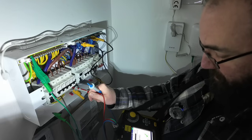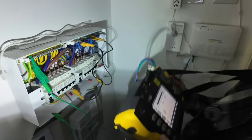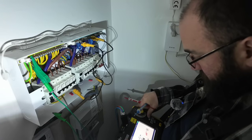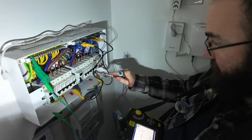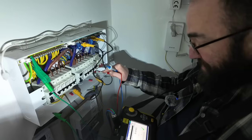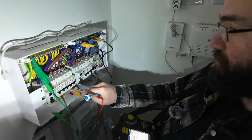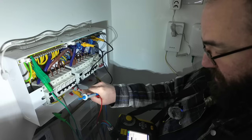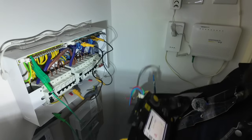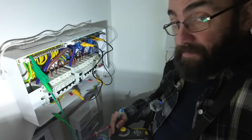Five seconds seems like a long time when you're standing in front of a camera. The second group reads 391 megohms. That was on 250V, so I'm going to up it to 500V and see if the results change. Testing at 500V — 515 megohms, it's actually gone up a bit. We'll repeat again and we are all clear. So on my test schedule I'll write the same value in all five boxes for that group and all five for the other — and that's how straightforward it can be.